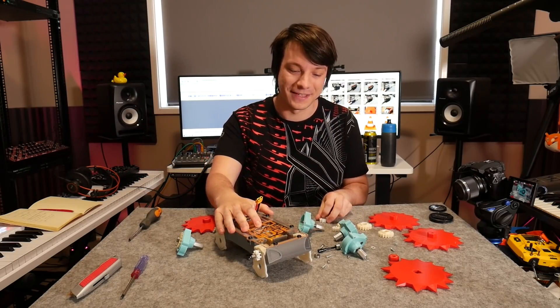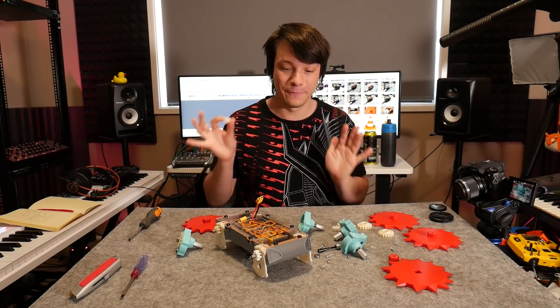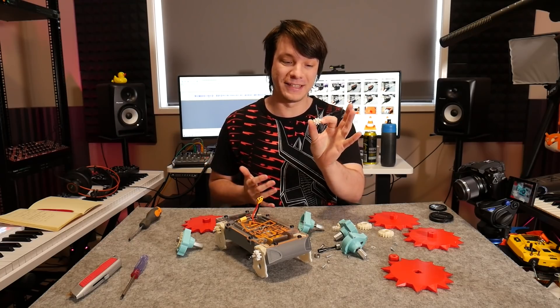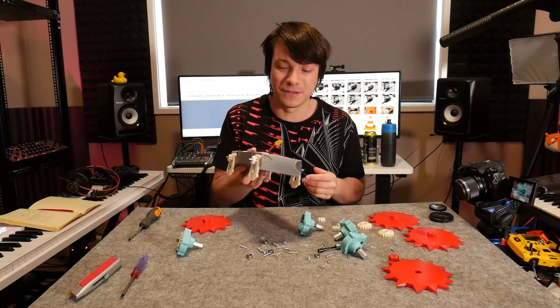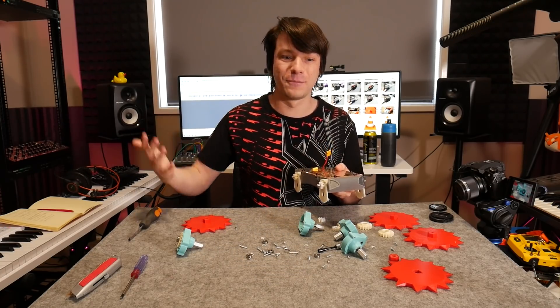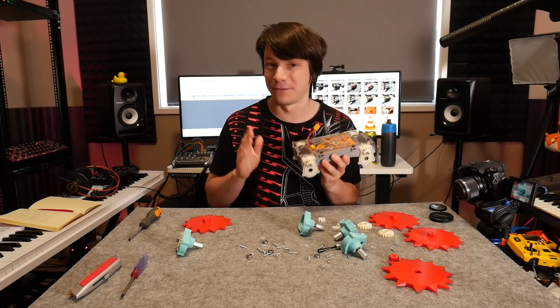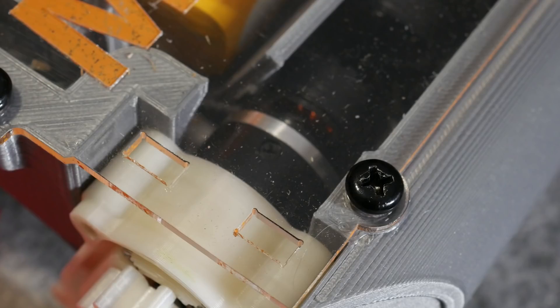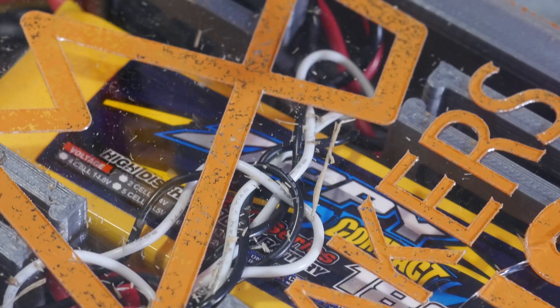What are our findings after this destructive test? I think that using these pinion gears as a mechanical fuse is perfect for this kind of application where you're using fairly expensive mechanical components that you want to protect. You can do it by just printing these very quick, easy, and cheap gears to act as a mechanical fuse to protect them. For stuff like this it's not mission critical if something breaks while you're testing - that's fine. Something like a combat robot is obviously a very different application, but for just experimental fun I'd much rather have a gear that breaks than a very fancy gear motor. The designs held up quite well but I do need to finish sealing it properly against dust and debris.